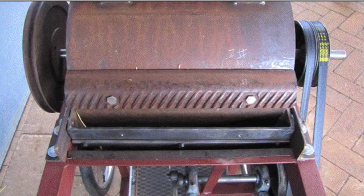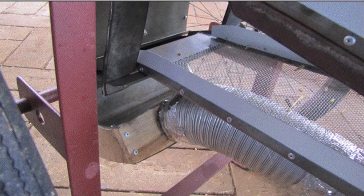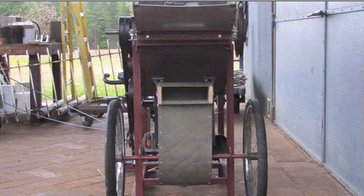The wheat, chaff, and some straw falls through the concave screen to the scalping screen, which is just 1/2-inch expanded metal. That screen sorts out the large debris, and the wheat and chaff fall through it to the lower screen, which allows dirt and small debris to drop, delivering the wheat and chaff to the vertical air column that winnows it. At the lower part of that column, the clean wheat falls through a slot to a container below.